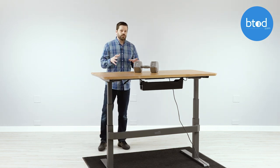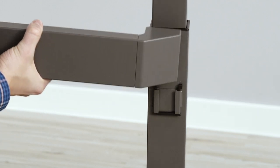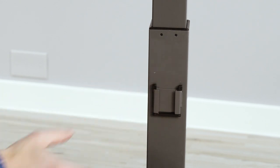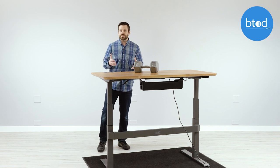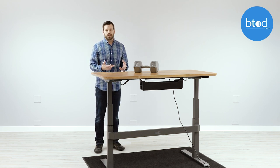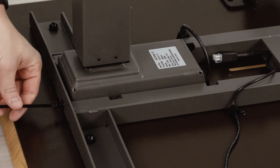With this particular test we found three different things that impacted the left to right stability. The first was the plastic inserts in the cross support — there's an interlocking wedge system, and when you pull off the cross support that connects to the column itself, there's a plastic part in between. This plastic part is not a solid connection; it's not as solid as metal on metal, so when the desk is rocking, that leverage into the plastic affects how it works, contracting and expanding as the desk moves. The next thing we noticed is the connection of the upper frame to the legs — there were really only two bolts connecting each leg to the upper frame support, and nothing counteracting those two bolts in the opposite direction during the stability test.